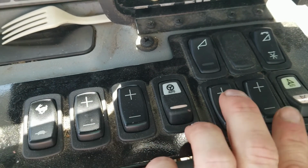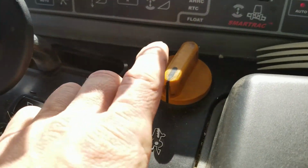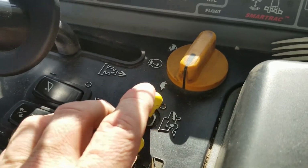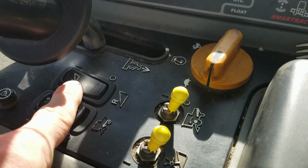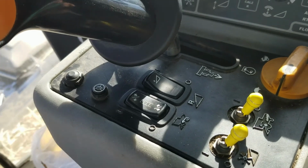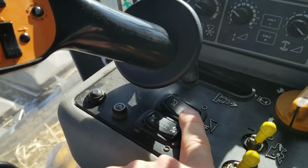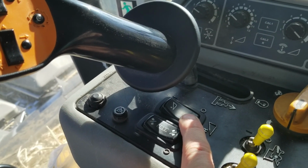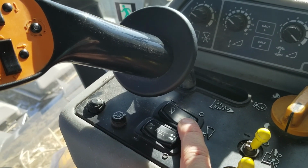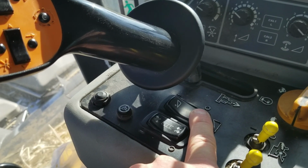And these are how I adjust the sieves from the cab. This turns on the auto steer sieve. There's the throttle, and this engages the separator, and this engages the head. And this is the reverser. Sometimes you get stuff stuck in there and you have to reverse it. It's a hydraulic reverser, so I know on the Deere we used to have, and I think the Cat we had before, it was mechanical and you had to throttle the machine way down. This one, you can leave it wide open and just run that, and it doesn't matter, it just runs the speed the same.